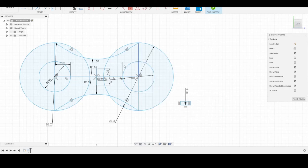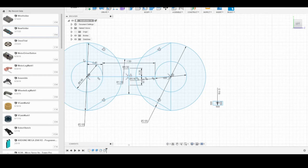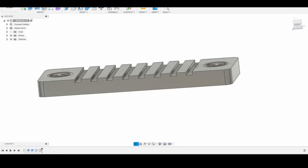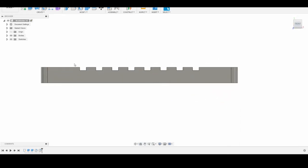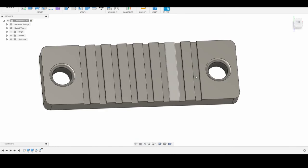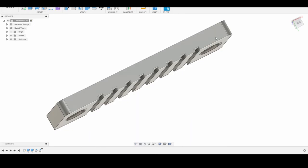And so we went on to a new design, which is just one half. Don't be surprised, it's just one half of two. When I said that there are two things clamped together with the wires held in between, this is basically what we came to. It's still very small, but a lot bigger than it was before. These holes are a little more than 1 millimeter, I think, just to help with the bends on the wires. The material here is about 3 millimeters thick.